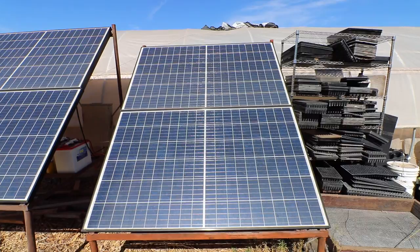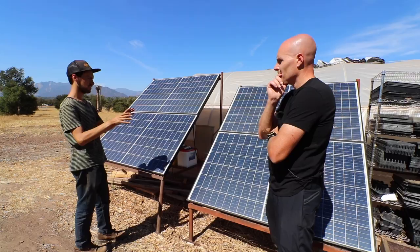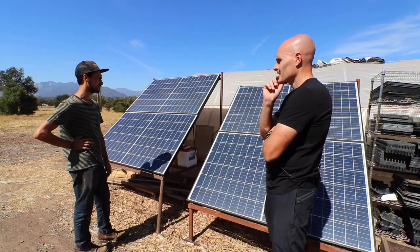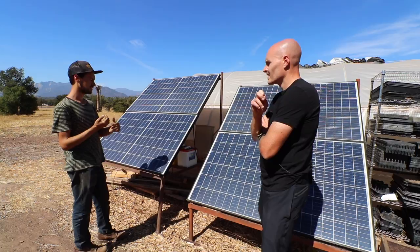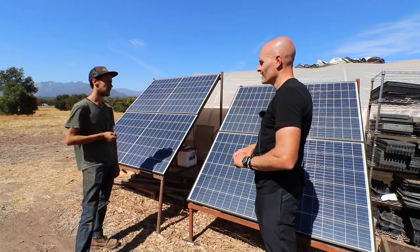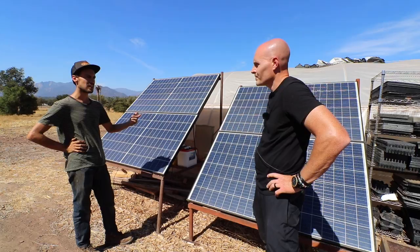What's the sizing on these panels and how many batteries? We've got eight batteries — they're 12-volt panels linked in series making a 48-volt system. The batteries are six-volt batteries, eight of them linked in series to make a 48-volt battery bank. There's a charge controller that shuts the power supply off from the panels to the batteries once they're loaded, and an inverter that lets us plug from a normal outlet. This has no problem powering the swamp cooler — we've had more than sufficient power on the hottest days, running it from about 10 a.m. to 4 or 5 p.m.